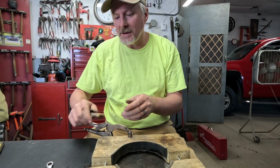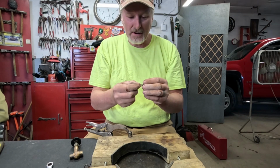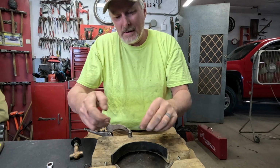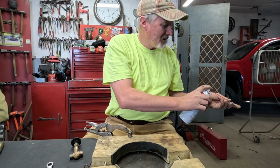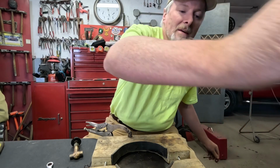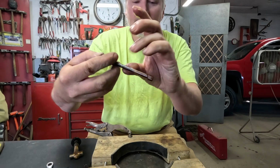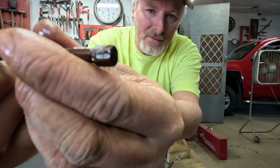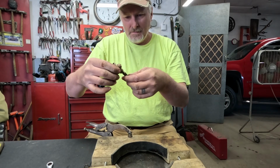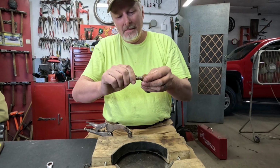So there's the valve assembly I'm going to use. I'm going to use the same pickup tube that was on that because I can see daylight down the middle of it. So I'm going to give that spring a little gentle stretch. And I'm going to spray a little bit of carb cleaner through this pickup tube just to make sure there's nothing in there that's going to plug anything up. Drop that down in there. I don't know if the camera will focus so that you can see how that comes out the end there. I know I've tried to show it before, but it never really shows up well on the camera. Oh, here we go. I tried to thread it on the wrong side. That makes a difference.